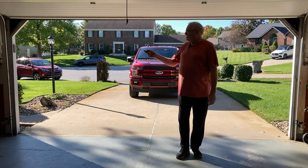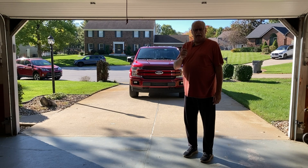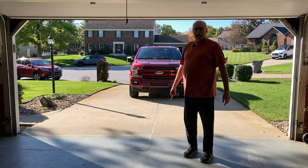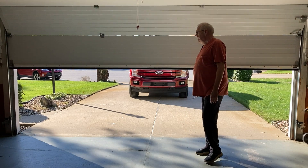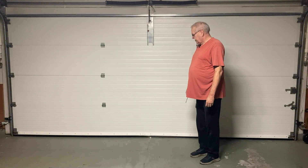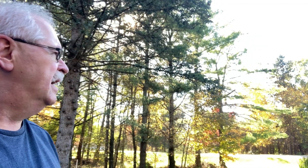After we got the strip on here, it sealed up pretty good. We had to make some adjustments to the downforce and the down travel on the garage door opener, and we also had to make some adjustments on the tracking because the door was actually sitting up a little bit higher. But anyway, this is the result — you can see a little bit of light, but it's probably less than it looks. There you go — perfect. Thanks for watching.